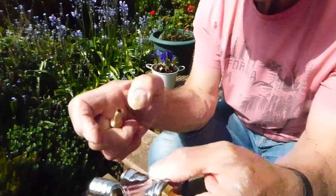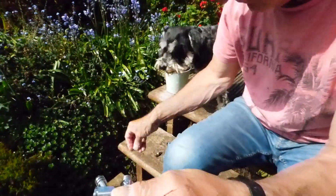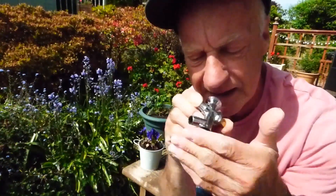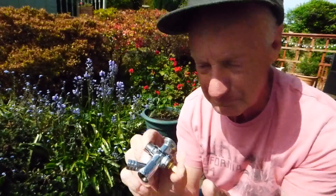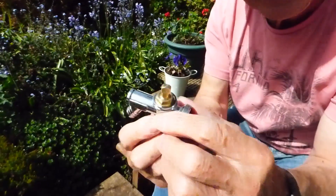So with that off, this valve is now off but you can still drain the radiator. If I demonstrate the valve being off by sticking my mouth through here, the air is coming out of the drain valve — so that means the water valve is off but we can still empty the radiator.